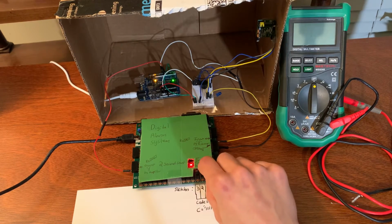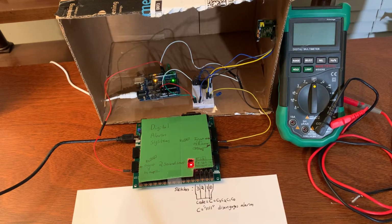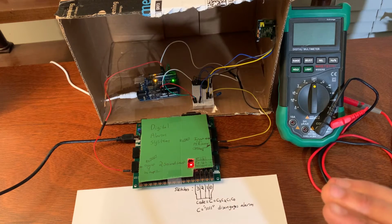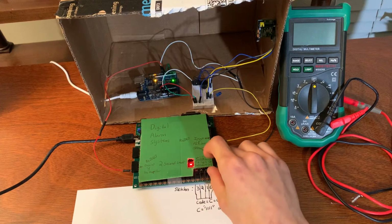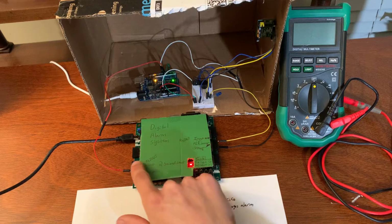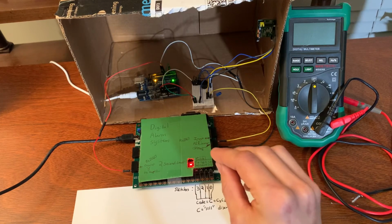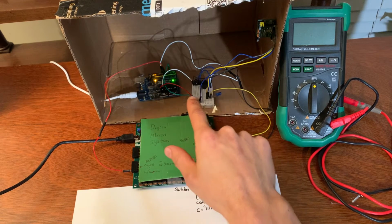If we engage by using any other code, so if I use 1110 for instance, this 2-second counter will, once motion is detected, count up to 2 seconds, which gives the user 2 seconds to be able to disengage the alarm. Again, put it back to 1111. And if the user does not, then this will output a high voltage through the Arduino into pin 7. And the Arduino has code which says if pin 7 is high, then pin 8, which is outputting across the active buzzer, equals pin 4.